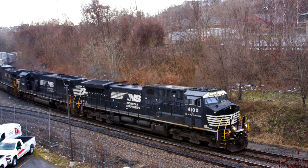The model designation for the Burlington Northern Santa Fe rebuild is the AC44C4M, only Tier 0 since it keeps the old 7FDL 16-cylinder prime mover and existing radiator cooling setup.